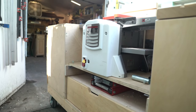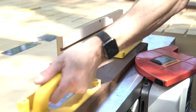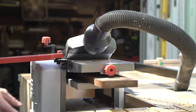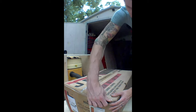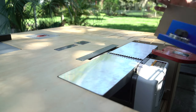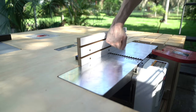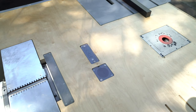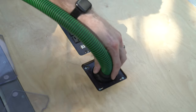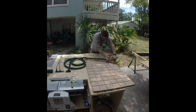The joiner planer combo — all the stuff to adjust it is in the drawer right beneath it, and the jack to move it between joiner and planer position sits on a shelf just above the drawer. I added leveling screws to fine-tune the height — this is all wood so it's going to swell and warp and may not be level tomorrow, but this allows me to adjust it. I solved the fence problem with my mag fence and a recessed steel bar, so whenever I need to use the joiner I can pop the fence on and off in seconds. I put a recessed power strip and dust port right in the middle of the top, all hooked up to the same auto switch and dust collection system — whenever I need to sand or route something it's pretty much plug and play.